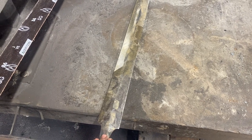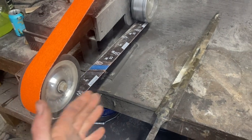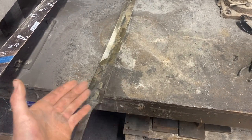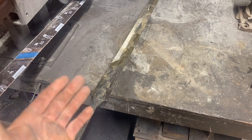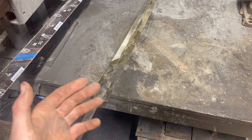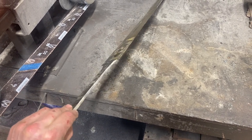Historically speaking on Viking swords, they had very wide shallow fullers that take up at least half the blade, sometimes more. To put it in we're going to be using this six-inch contact wheel. I'm sure some people are going to ask why we didn't forge in the fuller — if you forge in the fuller you have to grind over it to get a clean fuller anyway, and by the time you do that you might as well just grind it in — it's faster, leaves a better end result. Pretty much every professional swordsmith I've spoken to says just grind in the fuller, and there's really no structural advantage to a forged-in versus ground-in fuller.